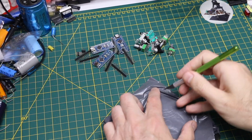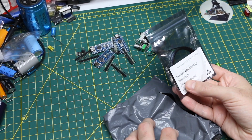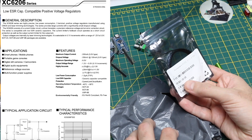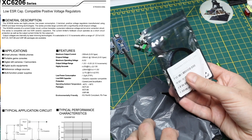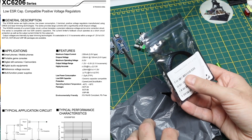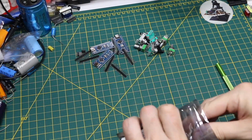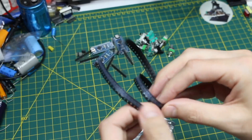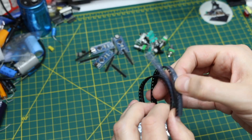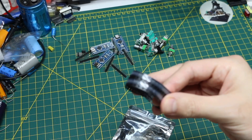General parts stocking. This looks like a voltage regulator — SOT-23 XC6206P332, so that's going to be a 3.3 volt regulator. I think these can do maybe 200 milliamps. I'm not sure if there are 50 or 100 of them. But I've got a PCB coming up that needs 3.3 volts, not much current, so I thought I might as well get a tiny package that can fit on the board.